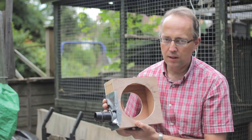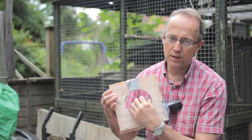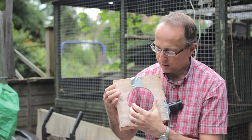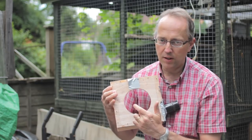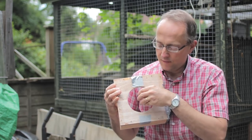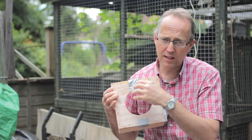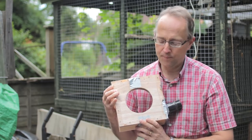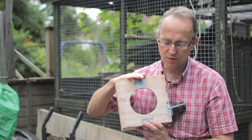The other learning point I didn't fully appreciate was that the air intake hole for the blower doesn't need to be as large as you think. This one is actually a little bit on the larger side — a bit smaller would be ideal, because if it's too large the air sort of leaks out the side. It's far better to have a slightly smaller air intake.